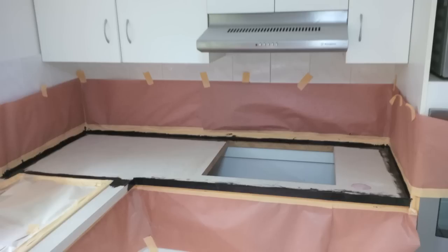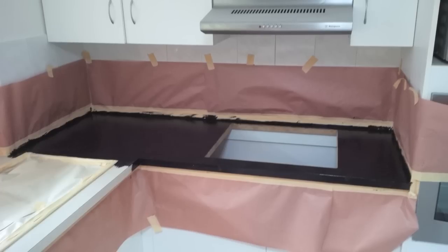This is the initial coat — sort of like the undercoat or bonding coat. The trick with this is you want to do one section at a time: do a small section, finish that section, put the fleck coat on it, and then move on to the next section. You want to start with the edges and make sure you get plenty of fleck on the edges.